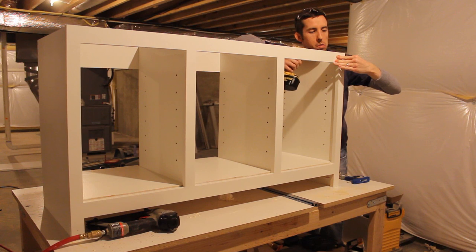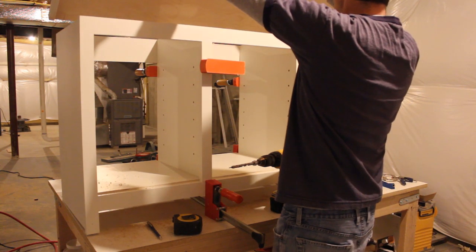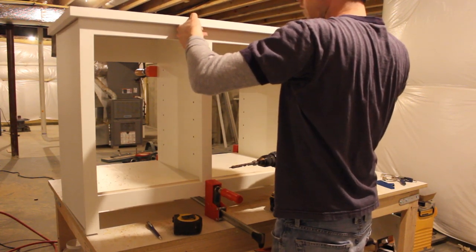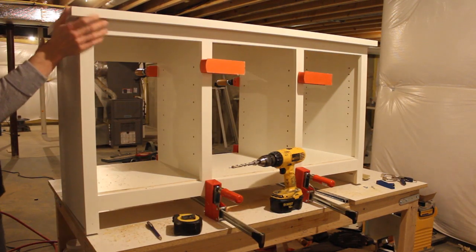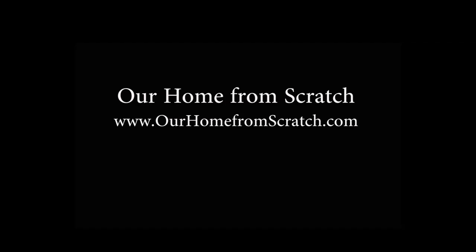With the face frame attached, I'm also clamping the dividers to the face frame from the bottom. I'm throwing on the countertop — a regular piece of plywood with a piece of poplar added to the edge to make it look thicker — flushed to the back. I'm putting a big bead of wood glue all over the top of the cabinet, setting the counter on, and holding it in place with pocket screws in the back strap and the inside face of the face frame. That countertop isn't going anywhere. Head over to ourhomefromscratch.com — in the next video we'll show you how to put the doors on and install it. Thanks for watching!